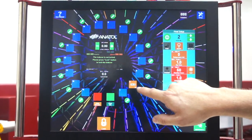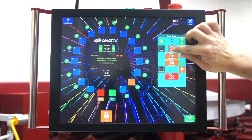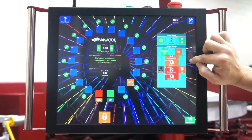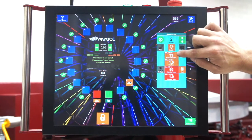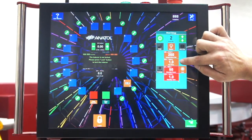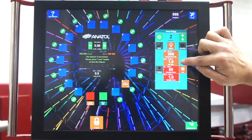You'll also notice that we get our temperature appearing on our palette. Once you've enabled the sensor and want to turn it on, again hit the quartz button, turn the sensor on here, and you can switch back and forth from Celsius to Fahrenheit here. This is our new flash window — we can set our temperatures here. If we want 250 degrees, we could type in 250 degrees. This tells us how long it wants us to hold that temperature for. The flash unit will get to full temperature and try to hold it for your specified time.